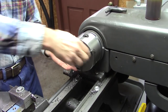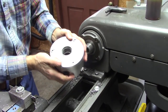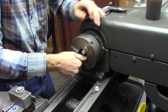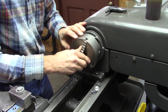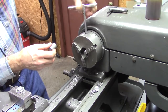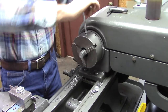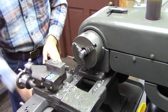This is a chuck that I just recently made a backing plate for that reduced the amount of overhang. It has no doughnut on the back and all the threads are on the inside. This chuck I'm putting on here is the original Logan chuck. If you look at it, it's very narrow this way. I made that other chuck because this chuck is getting worn, but it's still a good chuck.